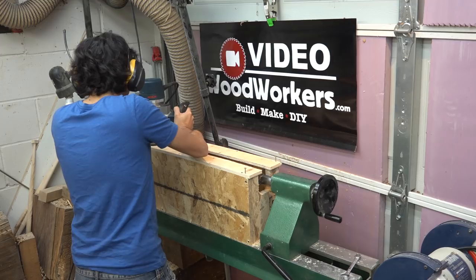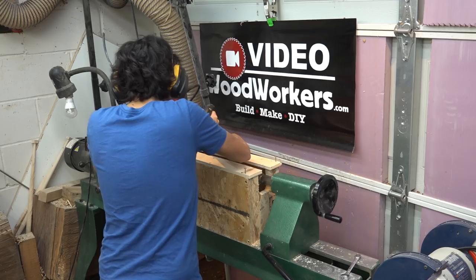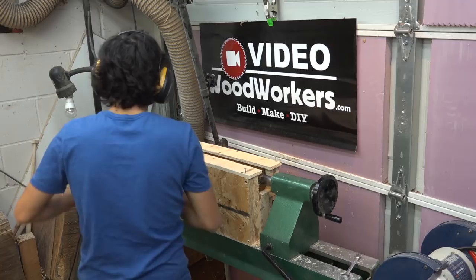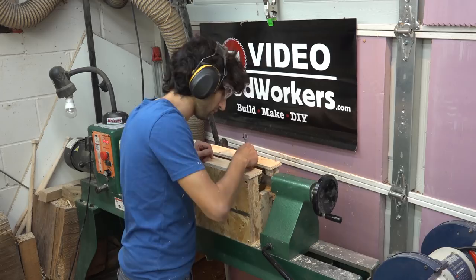You can see that I also added some screws sticking out of the top of the jig to stop the router before it contacts the tailstock. To set the final plunge depth, I use a half inch wrench to check the spindle's diameter at the point where it will be intersecting the crib's rail. I'm aiming for it to be a little larger, so when I clean up the spindle next, the diameter ends up at or slightly above a half inch.